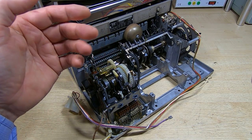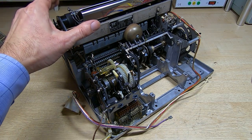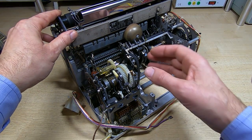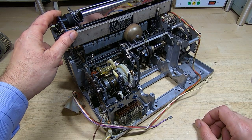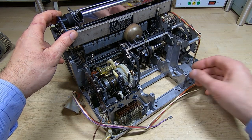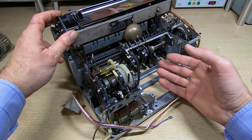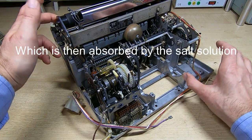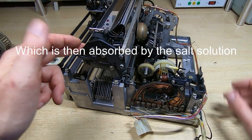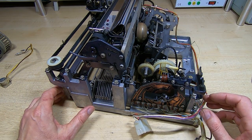And what that will tend to do is bring the entire air mass within the chamber down to about 32%, and effectively all the moisture that's in something like this will very quickly evaporate into the atmosphere within the cabinet. Because it's so dry, the water just comes out into the atmosphere, and being at 40 degrees it's very happy to give up the moisture. Something like this in 24 hours will dry absolutely completely in an environment like that.